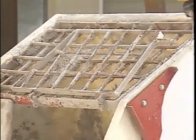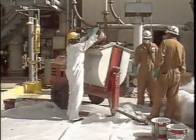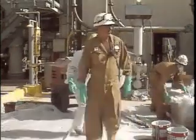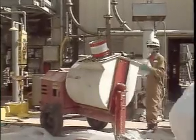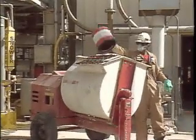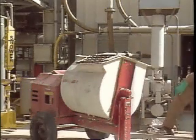Chockfast Red is mixed in a portable mortar mixer with a mixing speed of 15 to 20 RPM. After the liquids have been properly blended, pour the entire contents into the mortar mixer and immediately add the 4 bags of Chockfast Red low dust aggregate one at a time. Mix the Chockfast Red only until the aggregate is completely wet out, which will take approximately 1 minute of mixing time. Do not overmix.